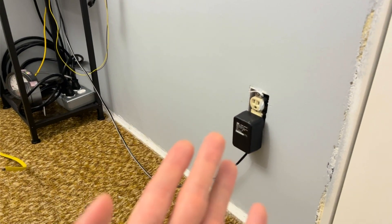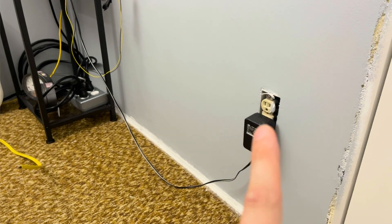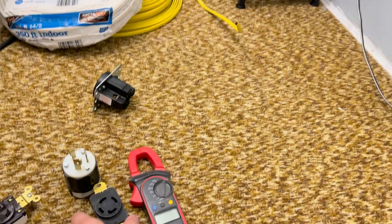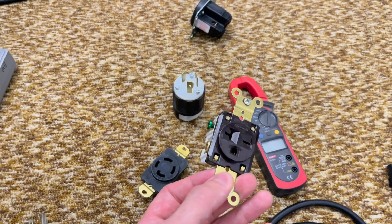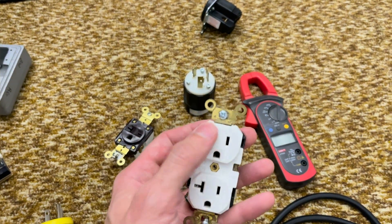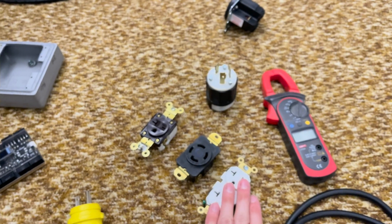Because of these reasons, even in a new home I would avoid running more than 50% of the circuit capacity at regular wall outlets. If you want to run more than 50%, make sure you have dedicated outlets. Generally, if you have a single outlet like this, it must be its own dedicated circuit — it must not be shared with anything else. But duplex outlets can be shared, so anytime you see a regular-looking outlet like this, it most likely has a bunch of outlets on the same circuit.